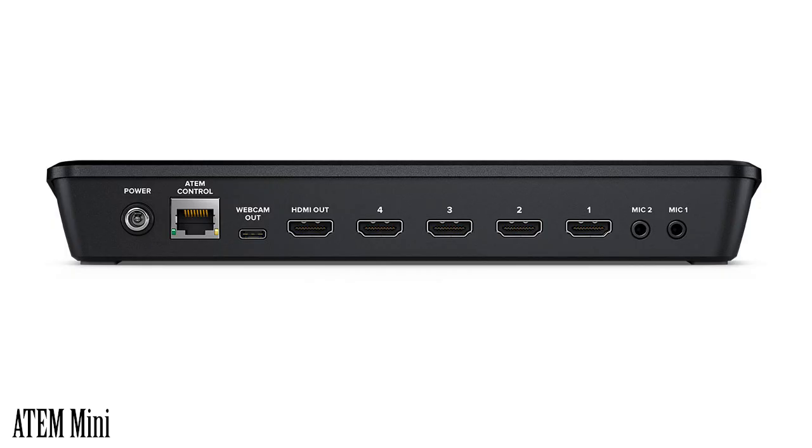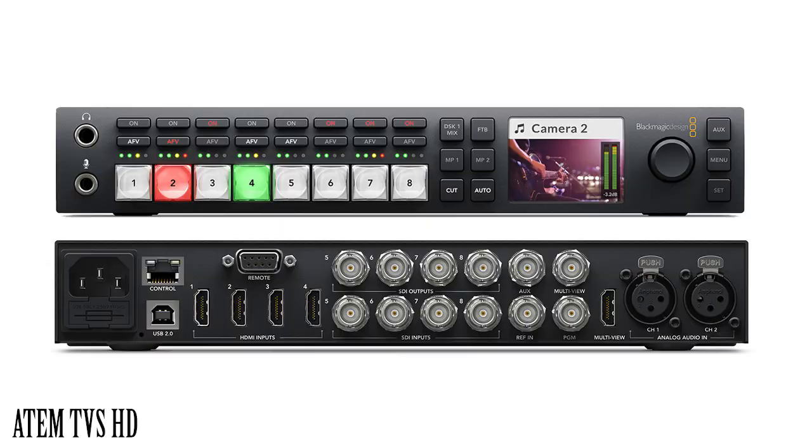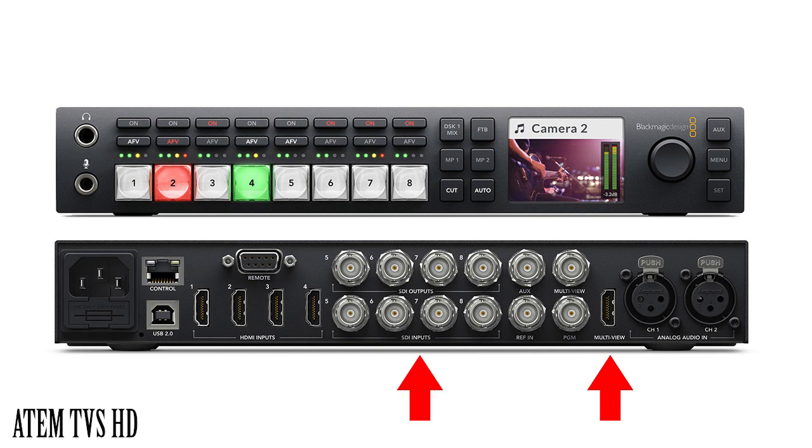I know the question that is on a lot of your minds — how do I get a multi-view with the ATEM Mini? Here's my answer and it might not be popular, but I think it's the right answer. The ATEM Mini does not have multi-view, and if you really need multi-view, save up and get the ATEM TVS HD, which has multi-view built in. There are a lot of videos on YouTube that will show you how to rig up a bunch of splitters and adapters and create a multi-view, and I'll link to one of the better ones in the description. But there are two problems: one, you'll be introducing a whole bunch of failure points and complications into your setup. And second, by the time you've spent money on all the peripheral devices, you've almost spent as much as you need for the ATEM TVS HD, which not only has multi-view but also has SDI inputs and an aux output — a lot more functionality for the cost.